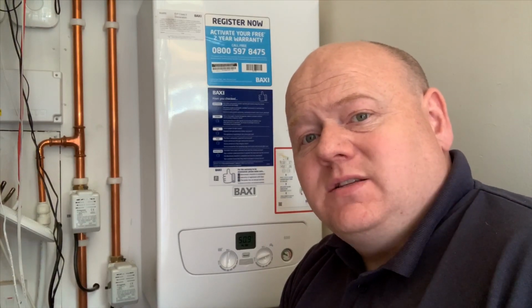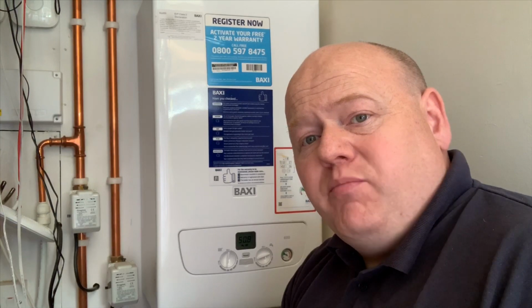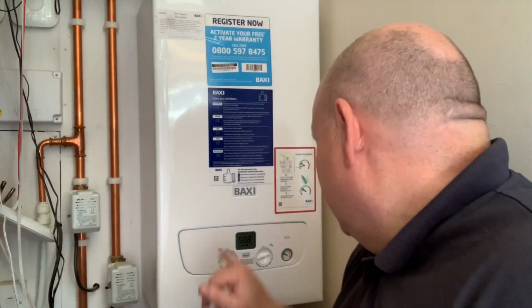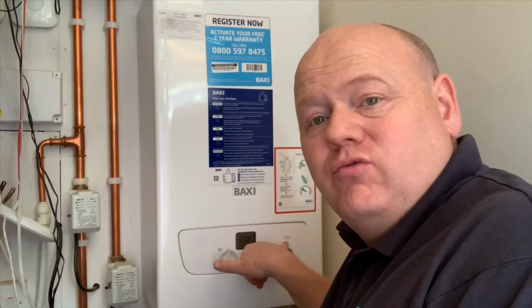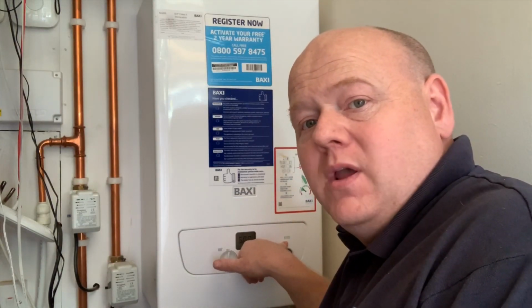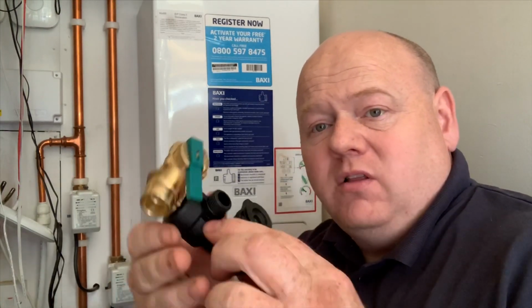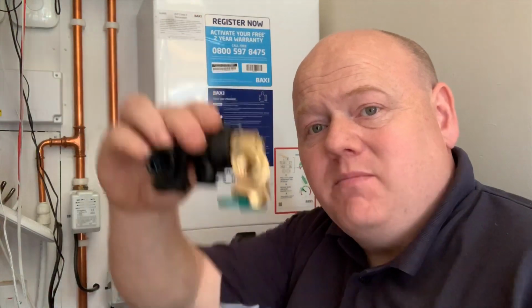My name's Alan Hart, and today I'm going to show you how to top up the pressure or repressurise your boiler if you've got an E118 fault code on your Baxi 600 combi boiler. And what we've got on the Baxi 600, we've got a quick fill or easy fill system. So E118 means you need to top up the pressure and put more water into the central heating system.